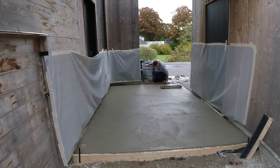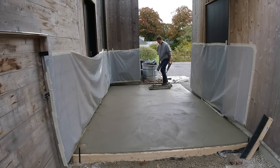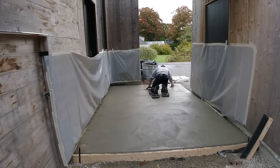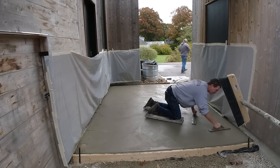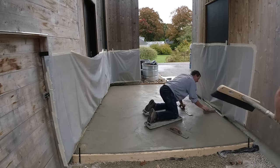We probably gave it 20 to 30 minutes, then came back, touched up the edges, and I'm getting back on it to mag it out again. It's going to be a lot drier and tighter on the surface but still moist enough to get a good tight mag float on it. Luke will drag the broom across. I've got a little hand broom for the overhangs on the edges and up against the doors, so when we drag the two-foot broom across, Luke can have one nice even pull without stopping or bumping into the door sill.